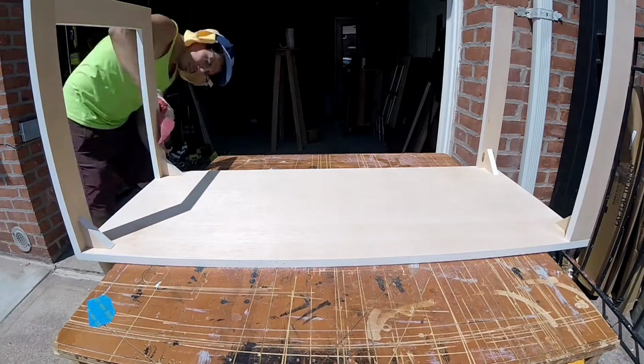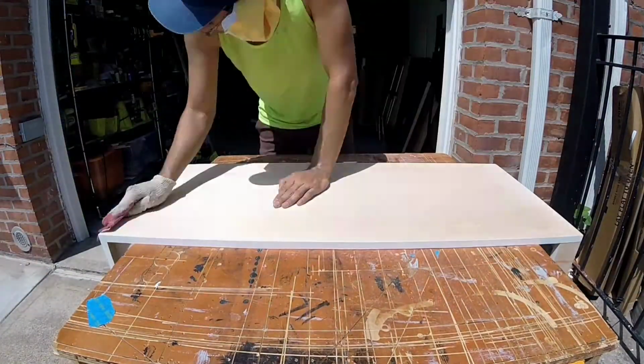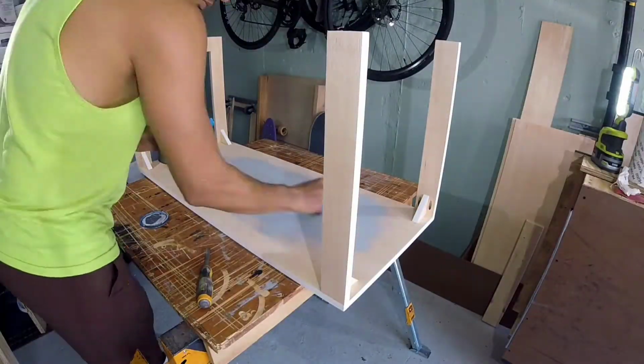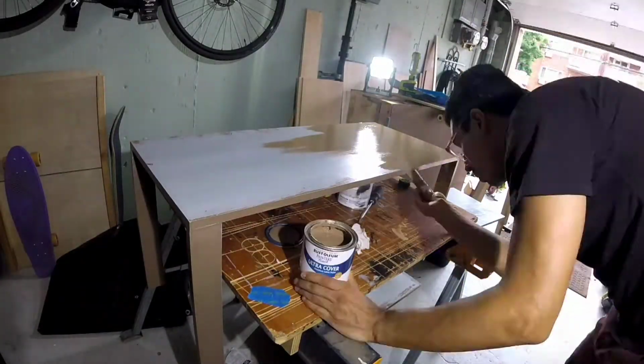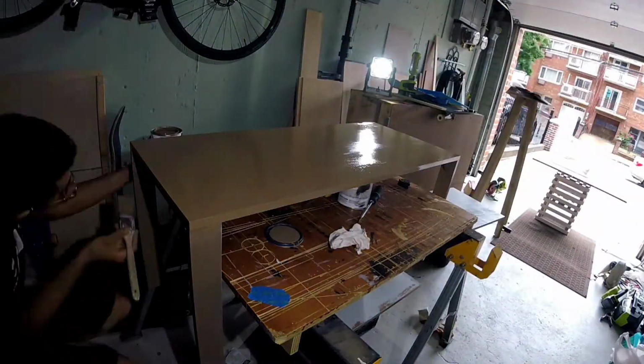And all that remains is to sand the surfaces and the edges, make sure there's no sharp corners that your cat might bump into, and then remove any remaining dust so that it's ready for paint and primer. And I did about 2 coats of primer and about 2 to 3 coats of paint, with light hand sanding in between coats to remove any rough spots wherever needed.